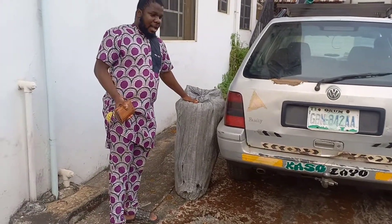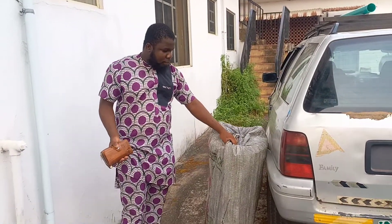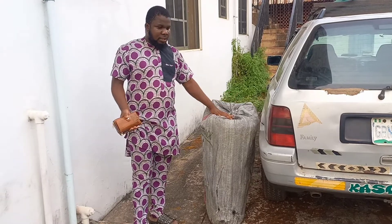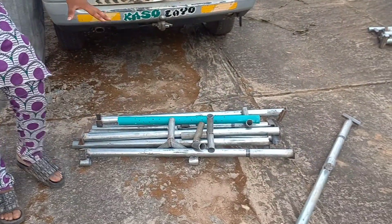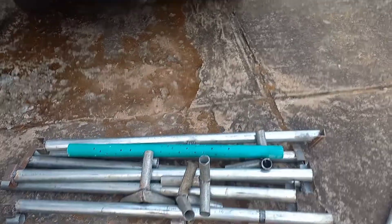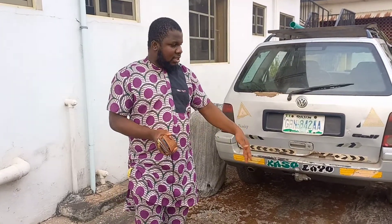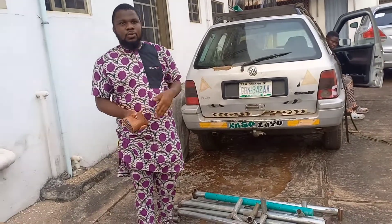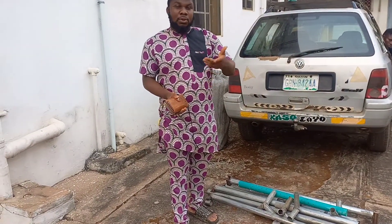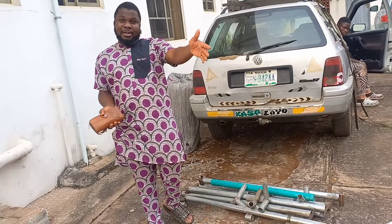This is a 15 by 10 by 4 feet tarpaulin. Now these are the galvanized pipes — these are the legs. For a 15 by 10 you always use 13 galvanized pipes. One galvanized pipe is about 17.5 feet, so you can make about three or four legs from it, covering the 15 by 10 length.